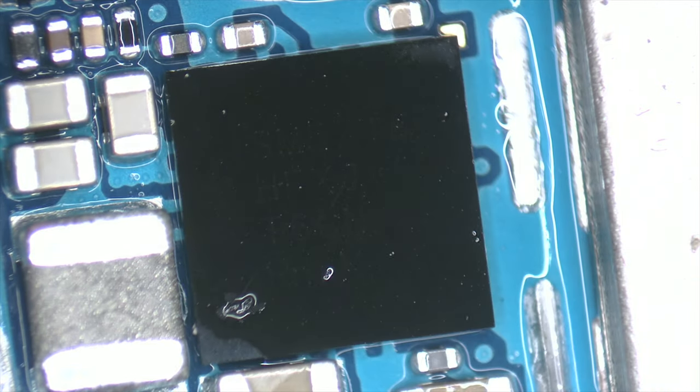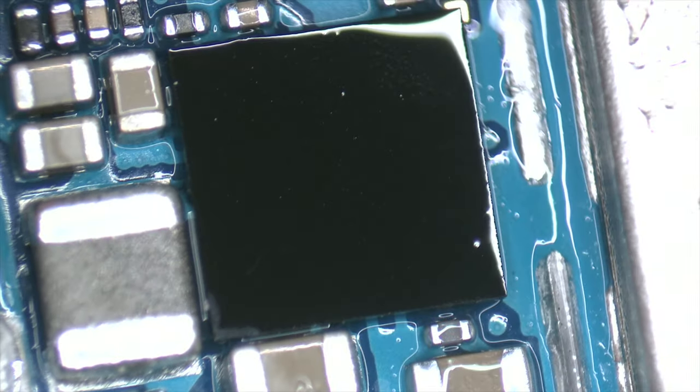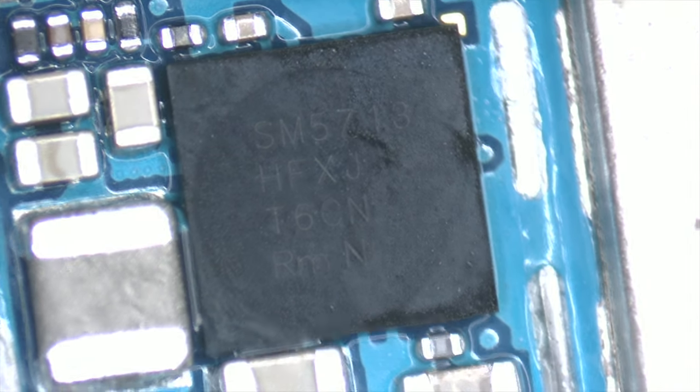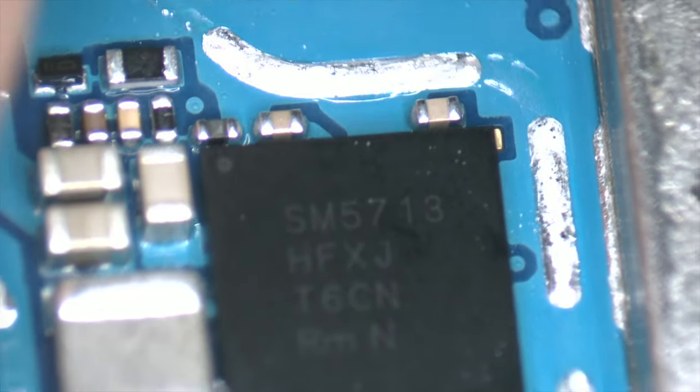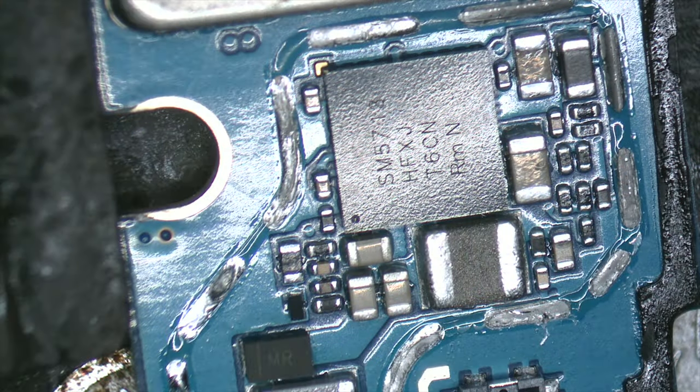Sometimes the device doesn't turn on with the laboratory power supply because batteries contain an identification ID line that communicates with the PMIC, Integrated Power Management Unit. This makes the device identify the battery and turn on. The bobbin located next to the IF PMIC serves a dual purpose, as it serves to charge the battery and also to supply power to the PMIC, Power Management Integrated Circuit.